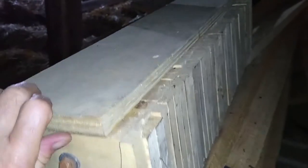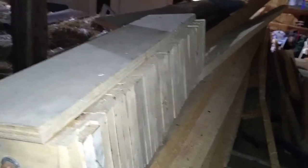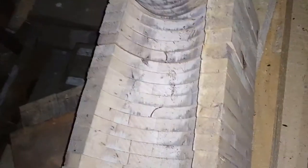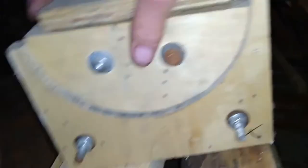What I did was I drew the whole thing up in CAD — what the blades were, the curve — best I could get from the old blade that I had. Since I didn't really have any way of machining this whole thing in one big shape, I took the CAD profile and split it into three-quarter-inch sections and made a little drawing for each one. I made each radius in each three-quarter-inch section of wood, then bolted all the pieces of wood together to get my overall die. I subtracted the blade out of the die so that when they're together with the blade in there, that gives the shape. Then I just put this in a hydraulic press, put the piece of sheet metal in there, pressed it down, and it gave me the shape I wanted.